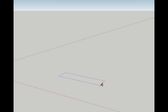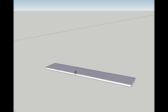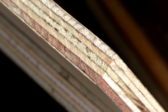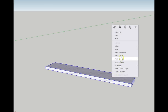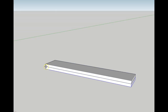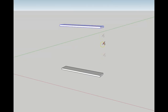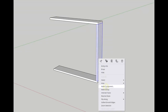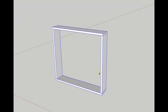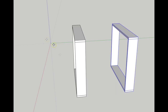Here I'm drawing the pieces for the arms. I start by drawing a rectangle to the dimensions I wanted and then I extrude the face by 18 millimeters, which is the thickness of the plywood I would be using for this project. I always use the group function to group the components of each shape together — that just makes things easier to work with and easier to select. That's the bottom of the arm, and I copy and pasted that for the top of the arm too because they're the same size. I moved it up to the height I wanted and then drew another rectangle for the upright pieces and extruded those faces by 18 millimeters too. Then I copy and pasted all that to give me the second arm and spaced them apart by the distance I wanted the width of the seat to be.